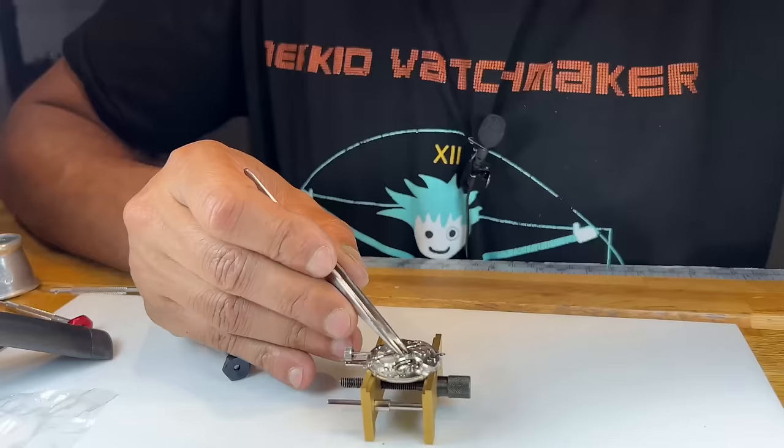So as you can see, this crown for the inner bezel, usually there is a screw here on some models which you can use to remove this whole crown and gear, but on this one I think it's friction fitted on and I don't want to faff around with it because it's a part that I won't be able to source if it gets damaged. But I can do the case back without removing that, and the case, as you can see, is completely free of any obstructions, so I can finish that off on the lapping machine as it has some really cool angles there, one here and one at the bottom. That will be relatively easy to do.